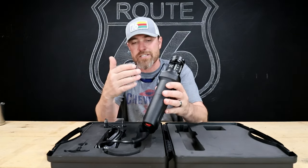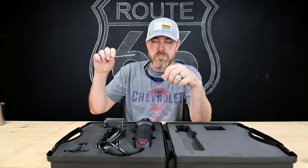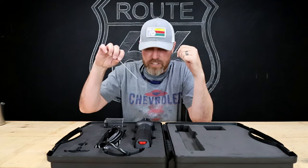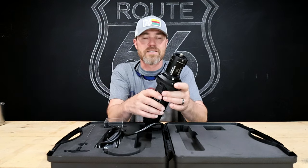That's why you need something like this — a dedicated tungsten grinder. You can take it over to the belt sander to kind of clean it up if you've got a bunch of junk on it, but your finish grind, your finishing sharpening, should happen on something like this.